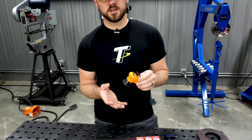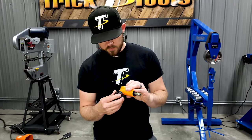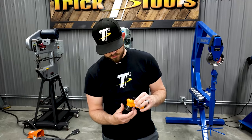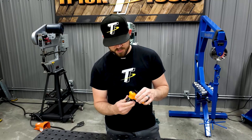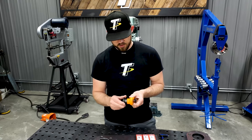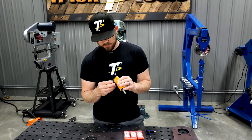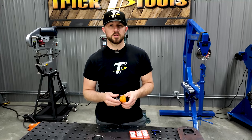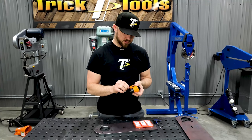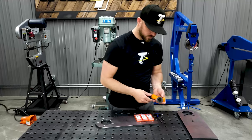In order to operate this thing, there's a guide here that sets your work height and changes the width of the bevel — how far the cutters are to the edge of your piece. There's a scale that goes from zero up to about 1.5. You loosen an allen set screw on the back, rotate the guide to move it in or out, exposing more or less of the cutters for your necessary depth. Then tighten it back up with the supplied allen wrench and you're pretty much ready to work.